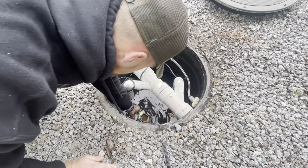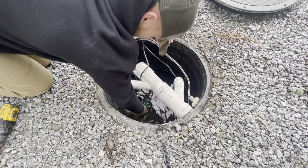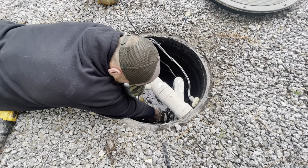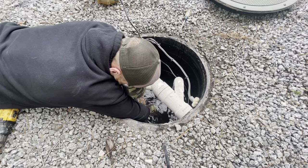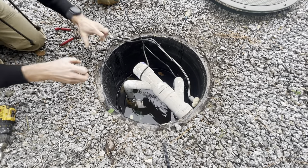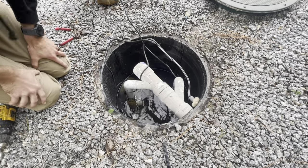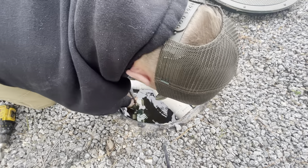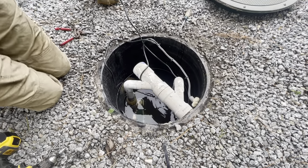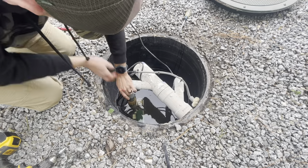The water was cold — I don't know what the temp was, but my hands were feeling it. That's why you see me taking a break and scrunching my fist trying to warm my hands back up. On private property you don't need to install unions. Your check valve is your union, and we have to have a check valve on this system — it's strictly climbing uphill. There's absolutely nowhere to gravity feed any drain system here, so this is what we opted to go with.